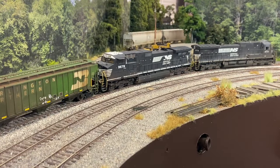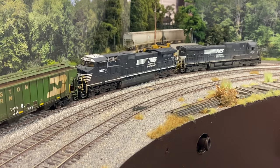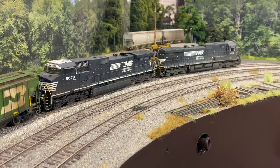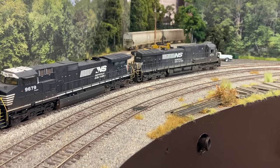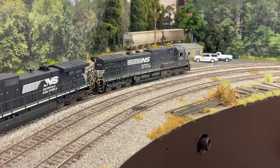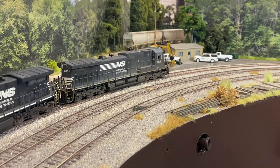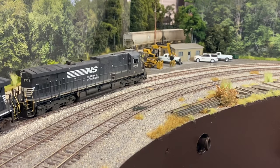In the last video, I may have got something incorrect about dynamic braking. Thanks to Greg of Fishplate Films YouTube channel, who is a fellow railroader from the land down under, I have some updated information. Instead of altering the polarity, as I said in the last video, the traction motors on the engine are essentially turned into generators by cutting the power to them. As the wheels rotate, the traction motors produce voltage, which in turn is fed into heater banks. They end up drawing heaps of current, which is used to help slow down the traction motors to aid in braking the train.